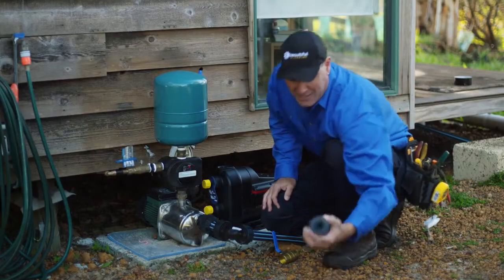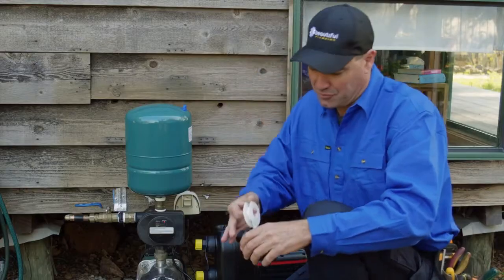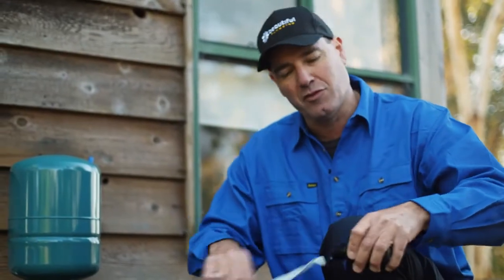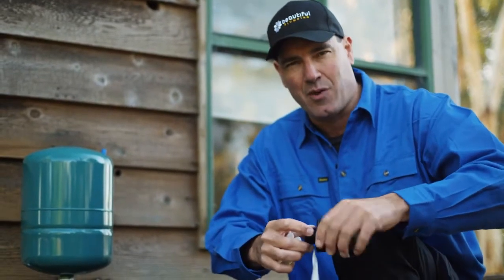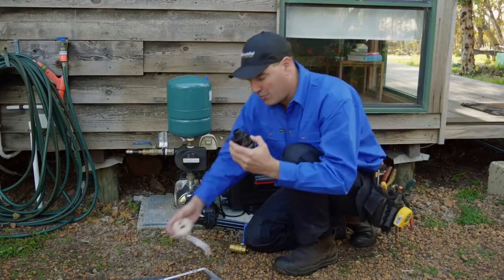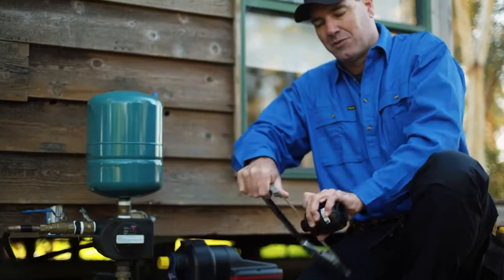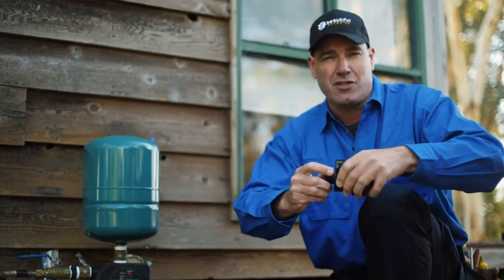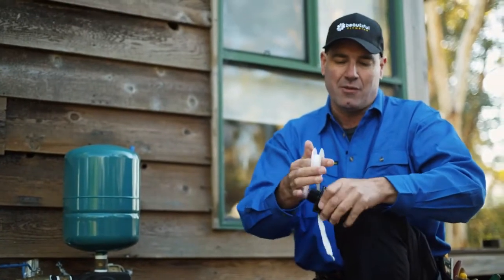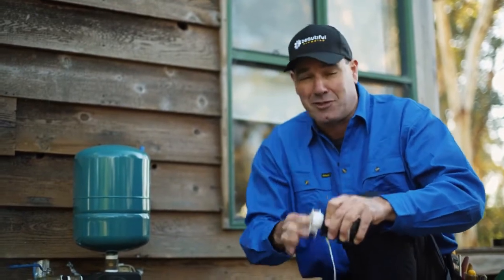So this is something important. When you have a plastic fitting with a thread on it, you can feel it's very smooth. If you put some thread seal on that and do it a couple of times around, the thread seal can turn — it doesn't stay where it is, it stays on the fitting and turns, and it will always have a continuous leak. So the only way to get rid of that is grab your hacksaw and just scratch it about four or five times around. As soon as you put your finger on it, you can feel there's grip lines. That's what bites the thread seal on. Always scratch the fitting. Then when you put the thread seal on and go around, it bites in, stays where it is, and it won't leak. That's a little tip from a plumber.